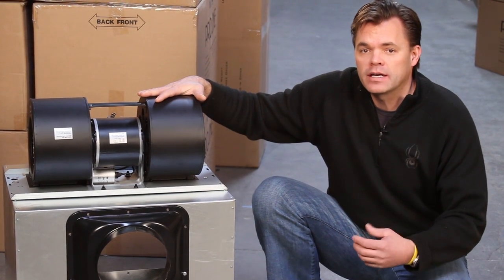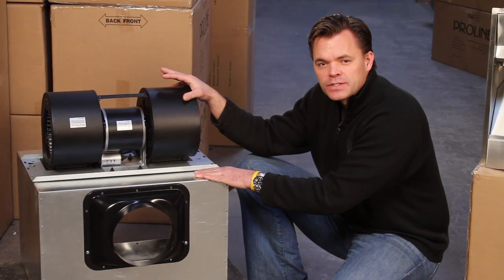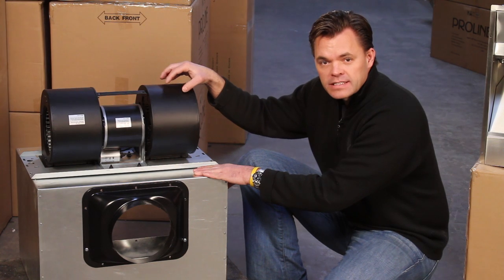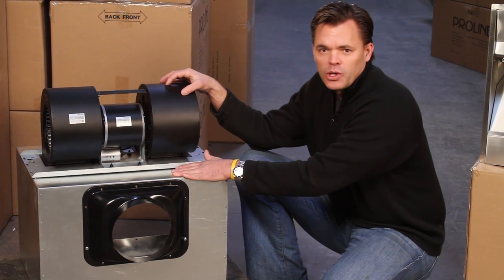So that's when you locate it away from the range hood — that's when you put it in a remote configuration. One of the best and most unique features of our range hood and blower package is that you can take the local blower, this motor, and make it into a remote blower by putting it inside a blower box.